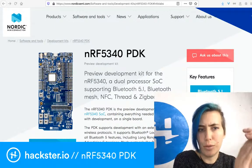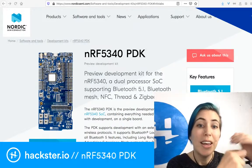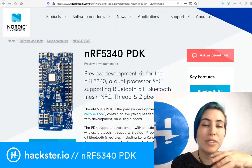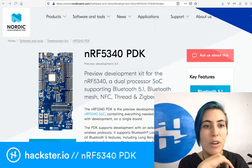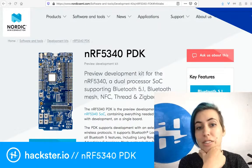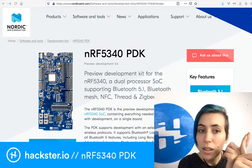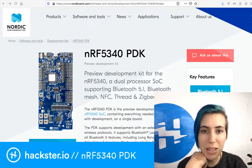For the security side, this chip incorporates ARM CryptoCell 312 technology as well as ARM TrustZone and secure key storage for the highest level of security. With ARM CryptoCell 312, the most common internet encryption standards are hardware accelerated, and ARM TrustZone provides system-wide hardware isolation for trusted software by creating secure and non-secure execution areas on a single core. The high-performance application processor runs up to 128 megahertz, 510 CoreMark, with dedicated 1 MB of flash and 512 KB of RAM.